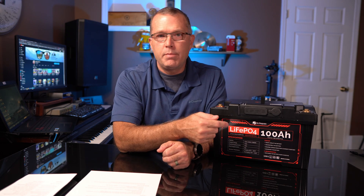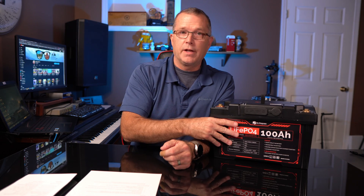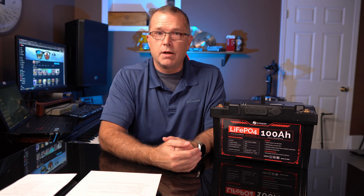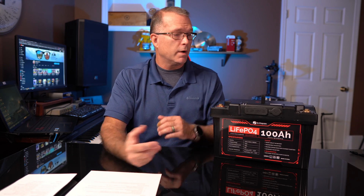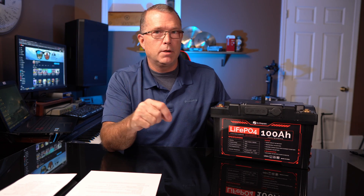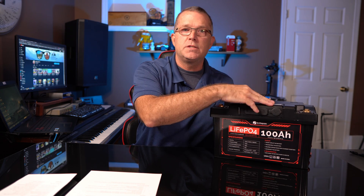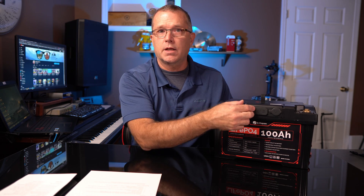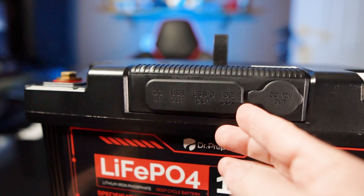The 100 amp BMS has a maximum discharge rate of 100 amps and a maximum charge rate of 50 amps — so just be aware it's a 50 amp charge rate. The PowerMax battery weighs 27 and a half pounds, which is pretty typical for a lithium iron phosphate battery in this capacity. This battery does let you connect up to four of them, but only in parallel, not in series. The reason is fairly obvious: this has a 12 volt DC output hub, and that hub is not going to work if you connect these in series — suddenly you're at 24 volts or 48 volts.